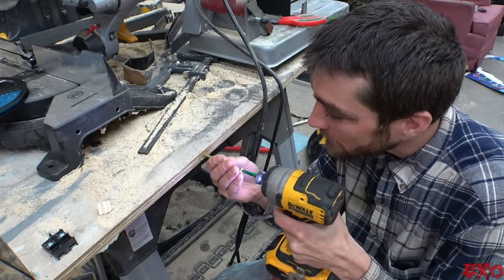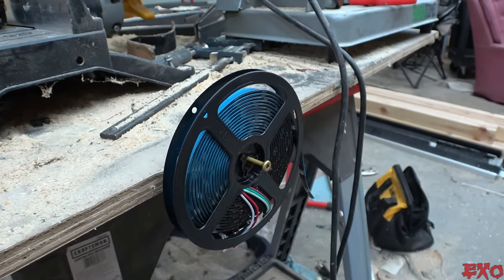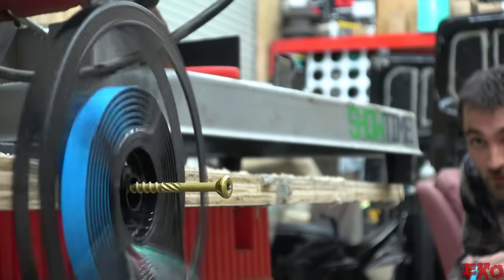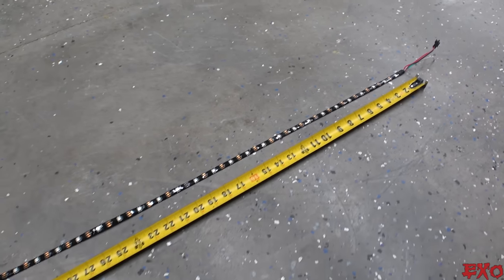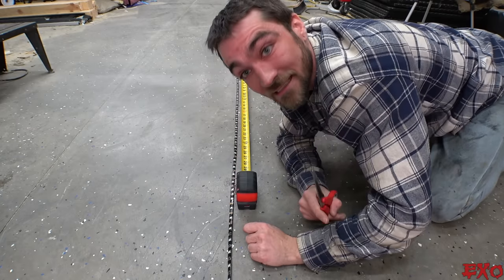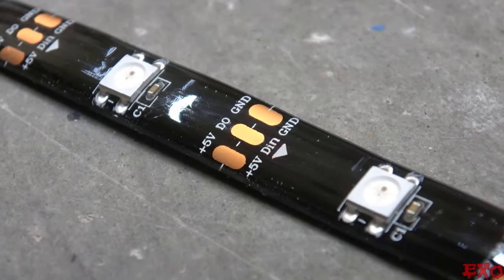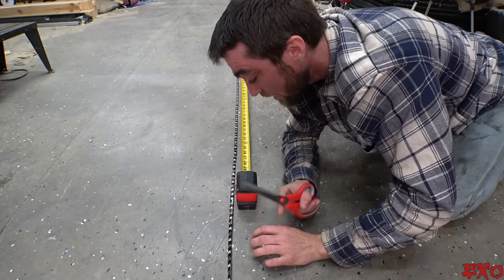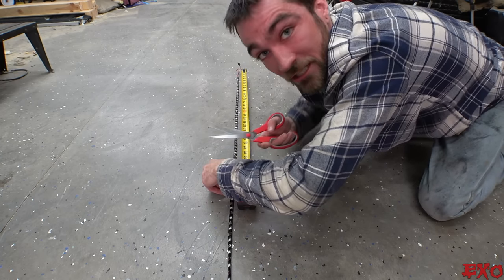This should help unroll her nice and quick. We're just about to cut this thing to size and realized that our data arrows are in the opposite direction. Since we have our inputs on the left-hand side, I don't want a bird's nest right in the center of my display. We'll have to cut off that lead down there and swap it, and solder our own leads right here at the 29.